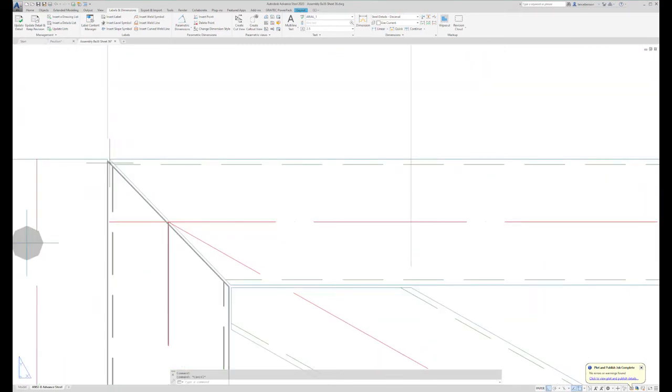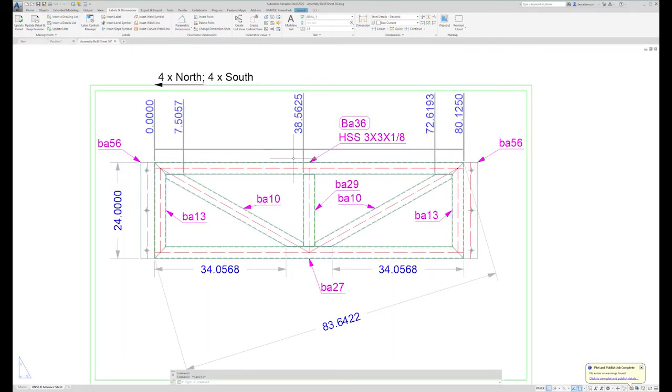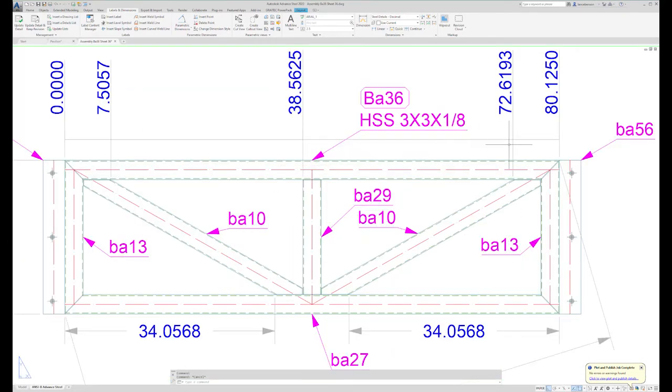Again, they're going to index or pull their tape off the tip of this. I would use a silver pencil and make marks progressively down my tube, and then transfer my lines over to the interior side on both tubes, because I need to know where this intermediate is going to land on both sides, on both tubes.